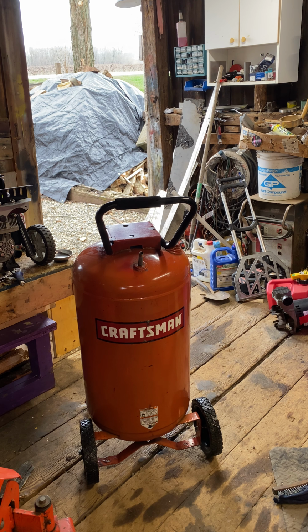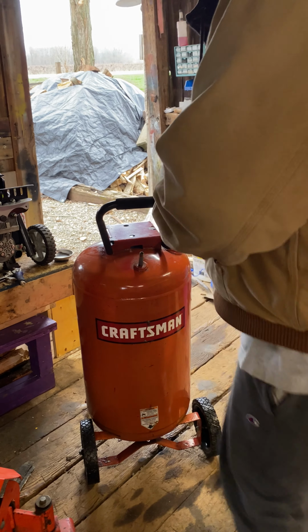None of that's gonna work. Yeah, so we're gonna have to get some more parts here for the rest of this, but right now I'll just Teflon the rest of this exit pipe up. It's gonna be the outlet pipe. Put a little Teflon on that. I use the yellow gas tape. That white stuff is just terrible garbage. Don't even bother with it.